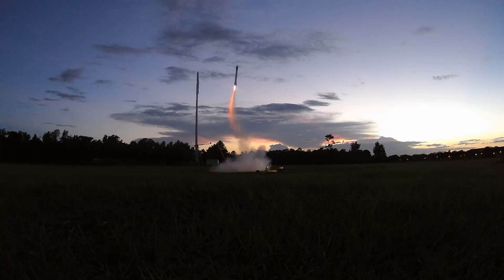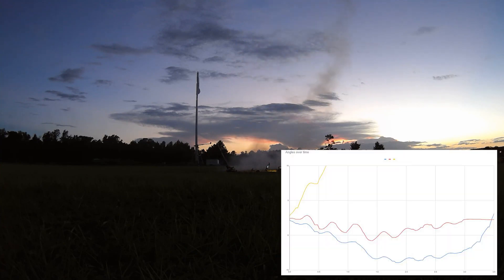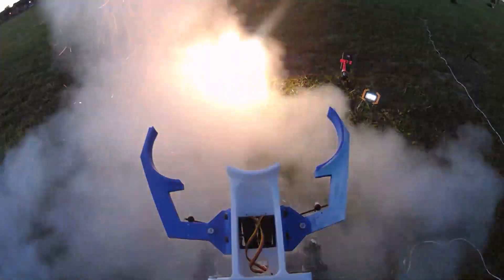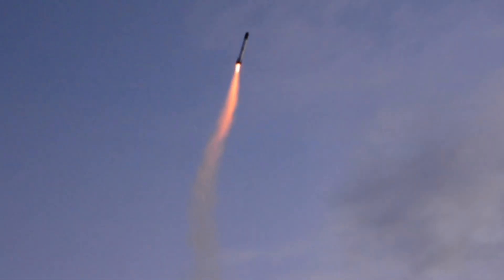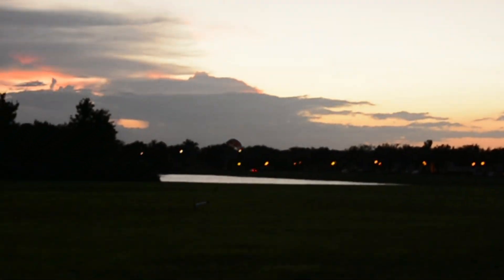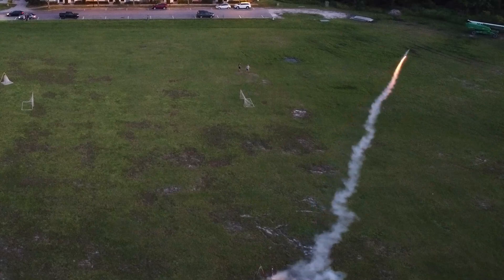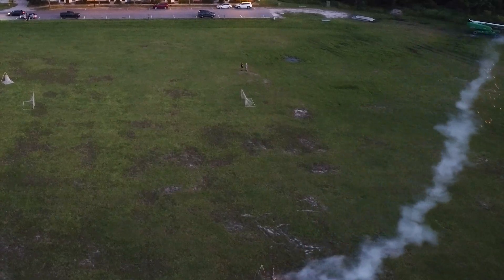The control gains are just a little too high — they were tuned for a weaker rocket engine that had less thrust and as a result less control authority. So while pretty minor, it is kind of cool to be able to see the rocket swivel and curve in flight as it's actively controlled. The fins and legs all deployed, although it's a little hard to see due to the lack of light, but I would consider this a very successful flight.